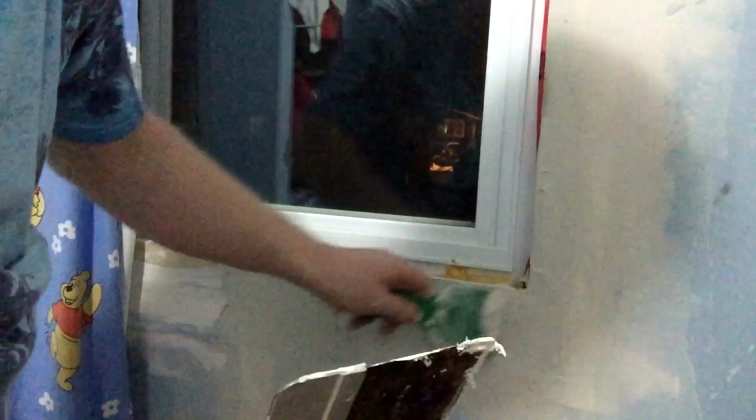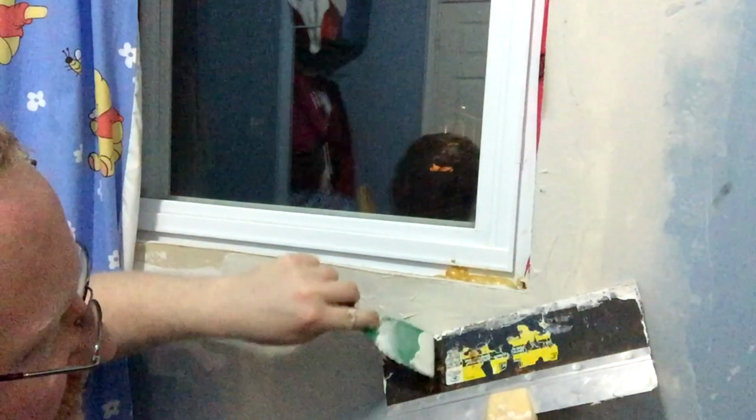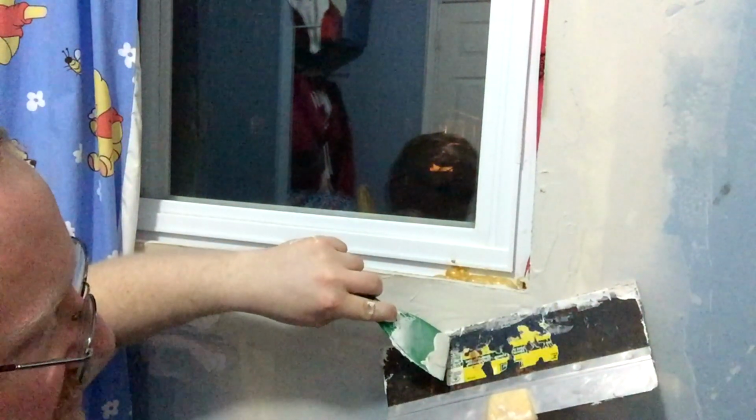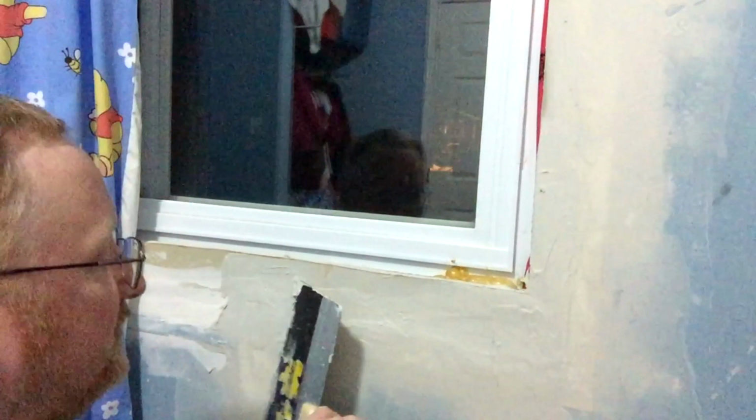Now down here where I've been working in this corner, I filled in this part fairly thickly. Now that doesn't mean a hell of a lot, because in this case thickly means maybe a 1/16 of an inch. It's not that much. But again, if I drag my knife down across it, keeping it on two known high points, I can see right along most of the blade to there. From about here to here, the blade's not touching plaster, which means I don't yet have it built up enough, which means I'm not going to get it built up enough in this pass.